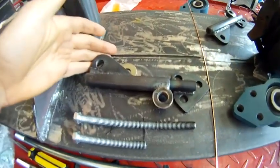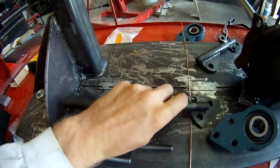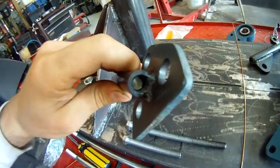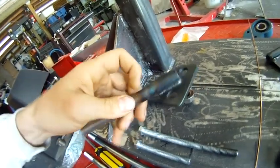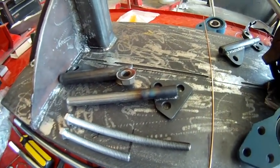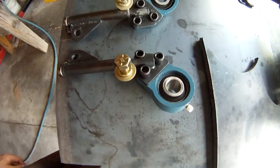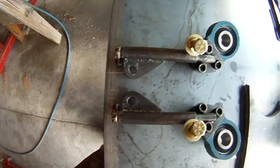And here I'm just showing you there's a bolt. I put the bolts in there before I welded the flanges on, thinking that it would protect those threads from boogering up if it got too hot or the weld started to penetrate through. Well, that was a bad idea because it either welded to that bolt or seized in there just from the heat, and when I was backing it out, it snapped off the bolt. Fortunately, there was enough thread in there that it'll still work, but eventually I'll have to replace it.